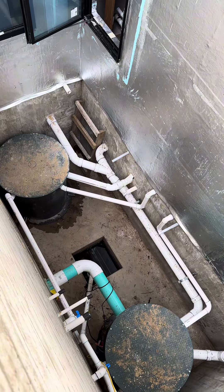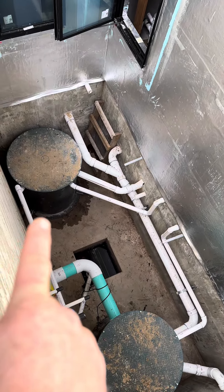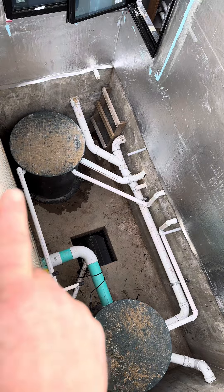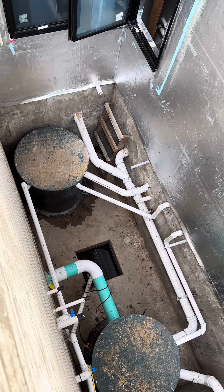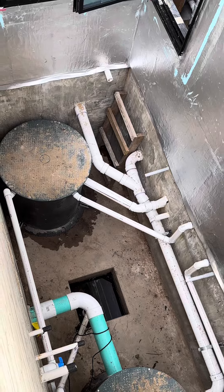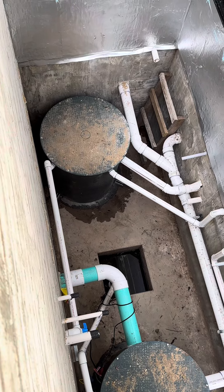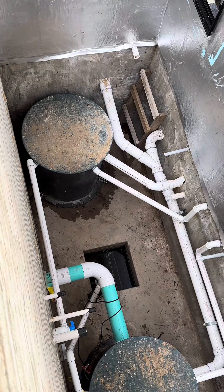The base of this natural light well — they're going to put some grading over the top of these tanks — but that tank over there on the left, or on the top of the screen, is for sanitary sewer ejection. That two-inch pipe coming out of it is the exit pipe going to the discharge. We've got a vent, another two-inch coming out of the wall into the top of the tank, and then that three-inch pipe going into the tank is the sewage pipe coming out of the house. So you've got a grinder pump in that big basin, and it's pumping up, tying into where the sewer actually exits the house, outside of the house — I don't normally see that.